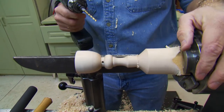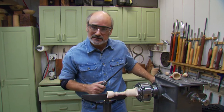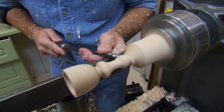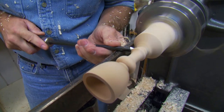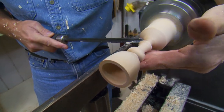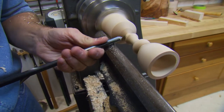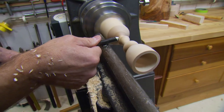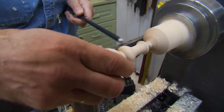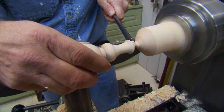What I'm doing right now is drilling the hole for the string to go through. Don't worry about the handle because our next project is spindle turning also, and it'll be easier to show spindle turning techniques on that. Let me show you how to part this off — that's one important thing. Either way, you can do this yourself or have your protege do it. But one important thing: do not grab it like this to part it off for the student. You have a sharp tool — if they push too hard, they go right into their hand. So you come over here, hold the hand like that to part it off — it's a little bit safer.